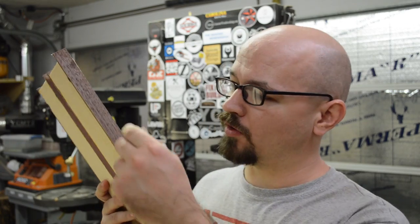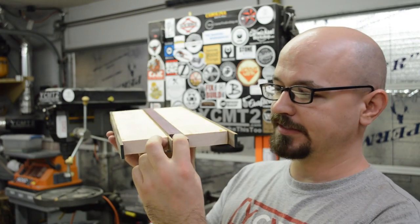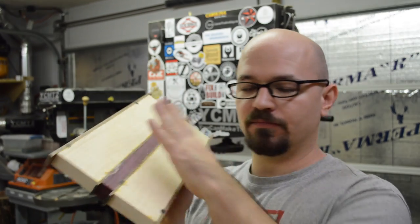The blank is dry and out of clamps. I was smarter this time — I made sure all the grain was flowing the same way, which will minimize chip-out on the jointer and planer. I want to run the side that was down on the clamps through the jointer, rather than the other side, because there's a proud bit there. If I tried to run that side on the jointer and it wobbles, that could get really dangerous.